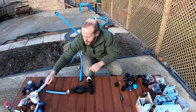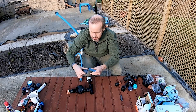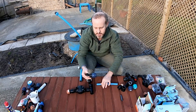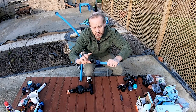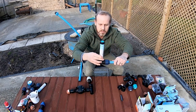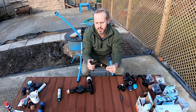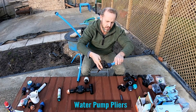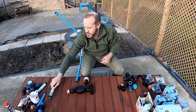I use these little 25mm inserts inside the pipe. When you do your connectors you don't need to slide them all the way out — half-slide them, push the pipe in, feel it click, then tighten it up. Your sprinklers go on top like that. For tightening, something like these plumbers' pliers is great — they let you make those connections without hurting your hands.